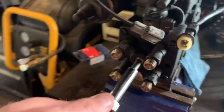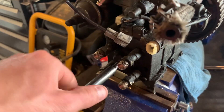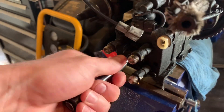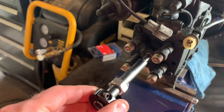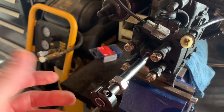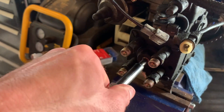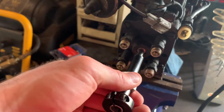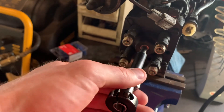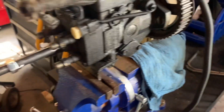All of this procedure can be found on page 11B-9 out of the engine handbook. You can find that on DelicaUSA's website — they have all the service manuals there for easy access. So you remove that bolt and thread this tool in hand tight. You don't want to go crazy; just tight enough that it's not going to back itself out.